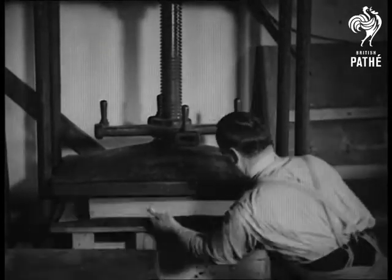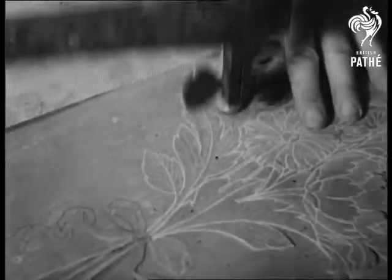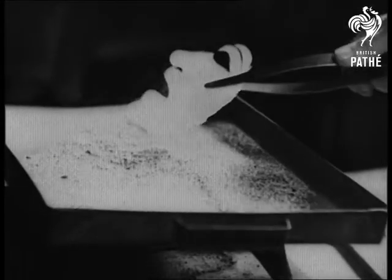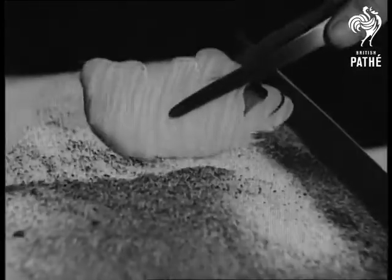The tracing guides the fret worker on his delicate task as he saws his way through the intricate pattern. With such thin wood and fine designs, a slight deviation from the pattern spells ruin. The tinting is obtained with hot sand, which chars the edge and gives the desired effect.